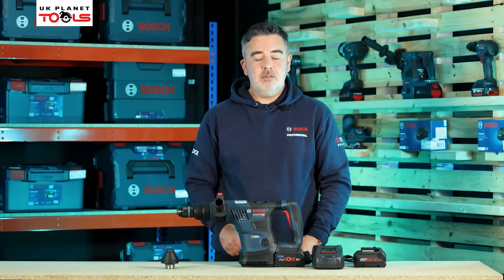When it comes to doing blade changes, it's very simple. We just pull this little red lever on the top of the handle, and as we drop the machine down it locks into position to give us access to the Allen key attachment on the side of the blade. We've got a hex key stored on the opposite side of the machine — we push the spindle lock and then release the blade to make any blade changes.